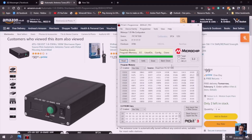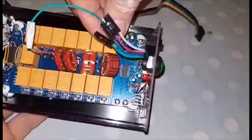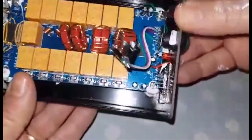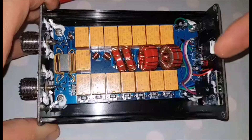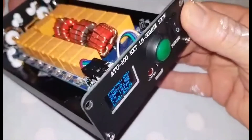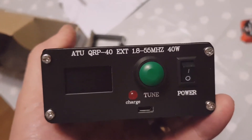Now the next part is testing to make sure it auto-tunes and kicks in at 1 watt. First, get the pins back onto the OLED screen — pull the extra pin off that you added, then curl the wires back around and put them back onto the four pins: blue, green, white, and red. Turn it on, you'll get the display back, and you're ready to test it on the radio. Put the lid back on — just two screws at the front top and back.